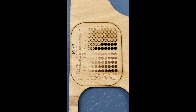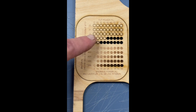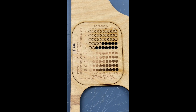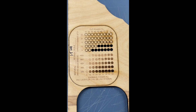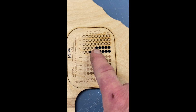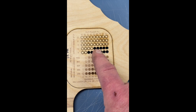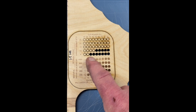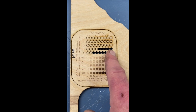This is the 1.5 lens. We ran a standard material test card. Some people will tell me that these little circles are not the greatest way to identify what power and speed you should use, but it gets you a starting point. For us, a starting point says 10 and 50, but we would probably go up to 60 or 70. It's called time and experience determining that, but these cut all the way through.